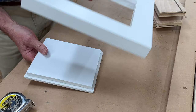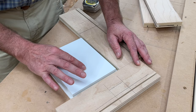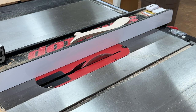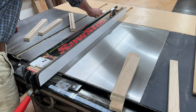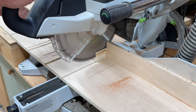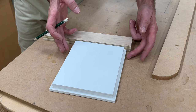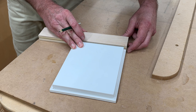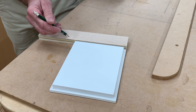To make the frame, first I'm going to make what I'll call a subframe — basically something that the panel will fit into with the flange. These are cutoffs. I'm going to start by ripping these at an inch and seven eighths. After making the rips, I squared up one side of each board. I'm going to cross-cut the shorter side first, letting it be just a little heavier than the panel is wide — maybe a light sixteenth. I just want the panel to fit in but not be too sloppy. I'll make this mark and cut both parts at the same time.